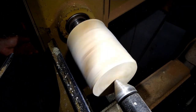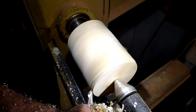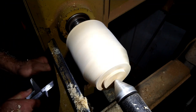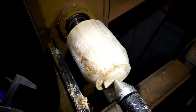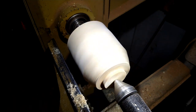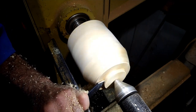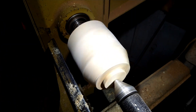Okay, I've got it round, so I'm going to crank the speed up a little bit more — we're cranking about 1150. I'll grab my chuck here. I'm going to put a tenon right there, that's right on the money. Take this parting tool and put a little bit of a dovetail on there. I usually use my skew, but you can use this parting tool. It's just a slight dovetail on there, just like that.